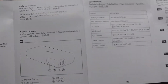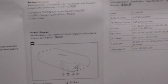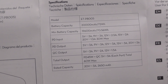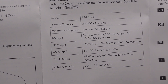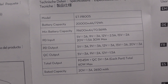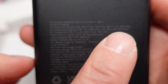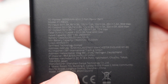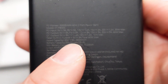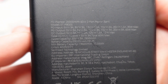The user manual is basic and to the point — you plug it in and it either charges or discharges. They state the modes of operation in essentially useless terms and fail to state all the modes of operation, which we will find out in a bit. The user manual may be a bit of an afterthought since it is incomplete. The power bank bears the UKCA and CE mark for its compliance testing but no US or Canada safety listing. Remember, the UKCA and CE marks are self-declarations, so no third-party testing was necessarily done. These generally carry limited value, but better than nothing.